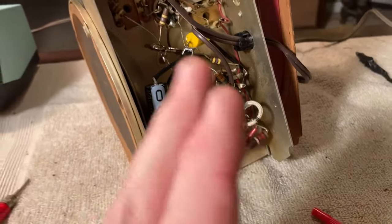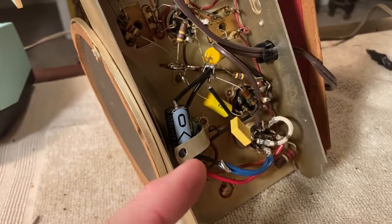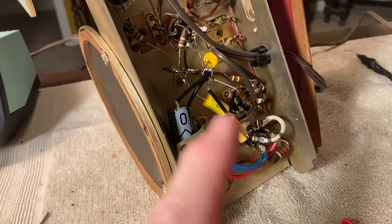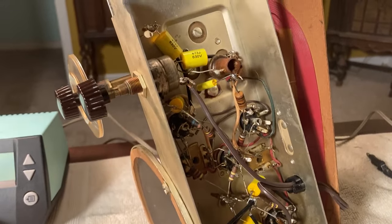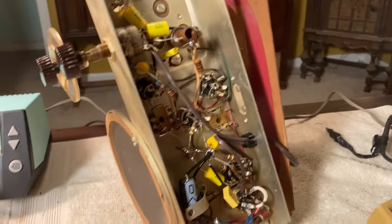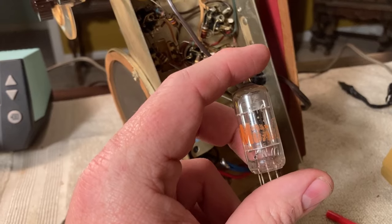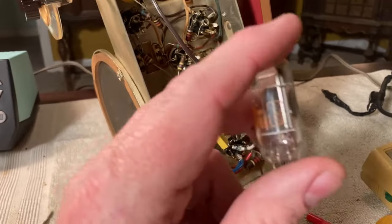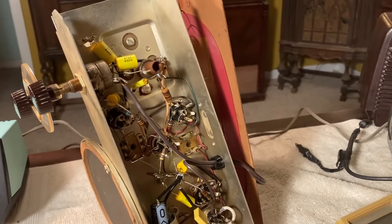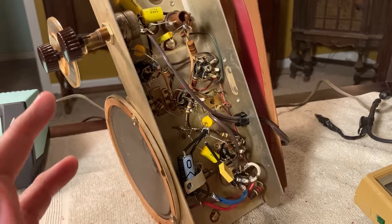I'm going to check resistors to make sure there's not one way out of spec — I've ordered some resistors too. This one has a 12AT6 which you can replace with a 12AV6. The 12AT6 is definitely bad — it's working, but the voltage coming off the anode is way too low. I'm getting like 34 volts out of it and it's supposed to be 57 volts. So I swapped in a 12AV6 and the voltage is correct. Let me show you the schematic. Here's my cap kit — all the resistors are still where they were. I replaced the paper cap with two axials, just used the wires that were on the paper cap, and there's our new line.